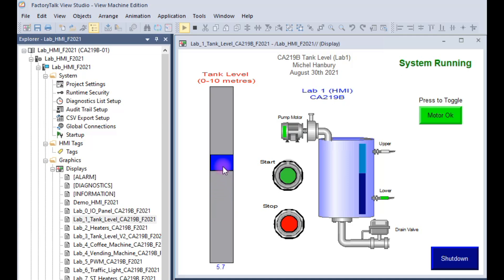Let's say I'm filling the tank, the pump motor's on, and we're halfway into the system and an overload occurs. I generate that by pressing this toggle button. The system is off — all of the output field devices are de-energized, so the pump motor is de-energized and the drain valve is de-energized. The water is held at its current position; it's not going to drain or fill. If the overload is removed, the system should not restart until I press the start button.